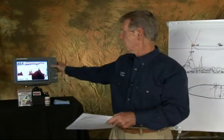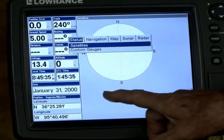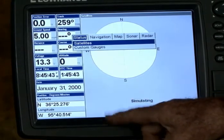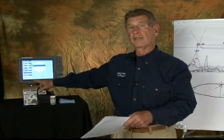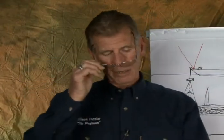On Lowrance units, if you go to Pages, then over to Status, you'll see a little bar with numbers underneath it. If it has no blue in it and it's just sitting there and never shows a bunch of bars across the screen, then the antenna's bad. It's working, but it's not working — so that means the antenna's bad. But if the electricity's been paid, the wires are good, and you don't see any bars, then you have a bad antenna. I hope that helped you.